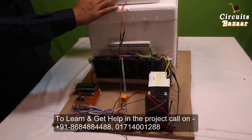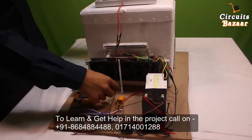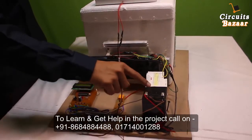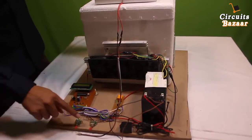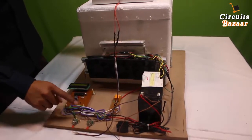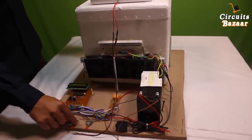At this point the battery is discharged and the solar panel is not charging it because the solar panel takes a lot of time to charge the battery. If you need urgent charging, you have to manually charge it — on these two points, positive and negative, you can apply a charger to charge the battery in fast mode. This button will cut down the circuit's power supply.